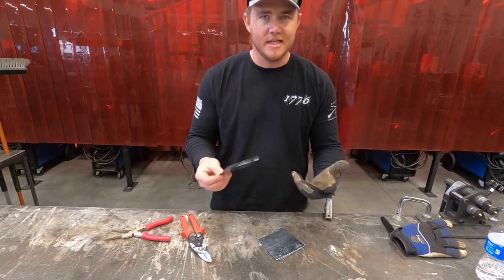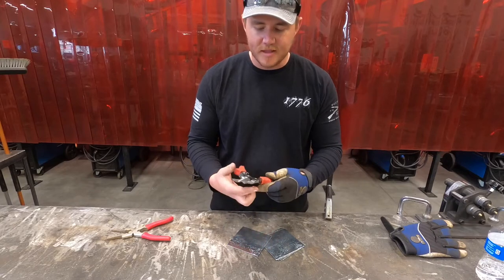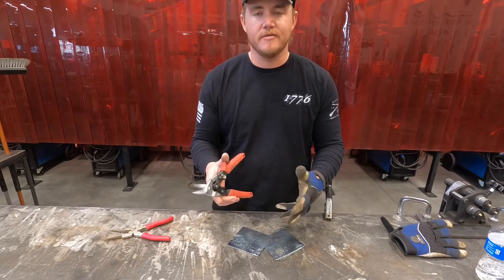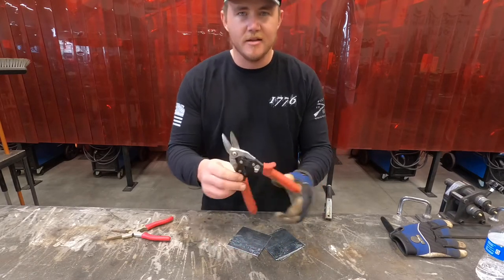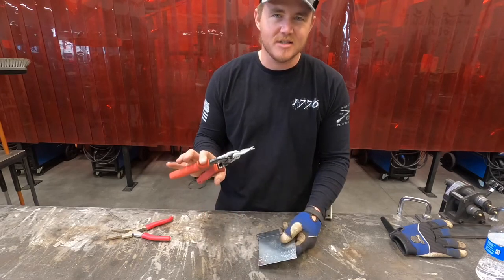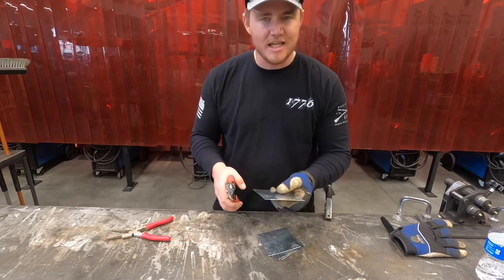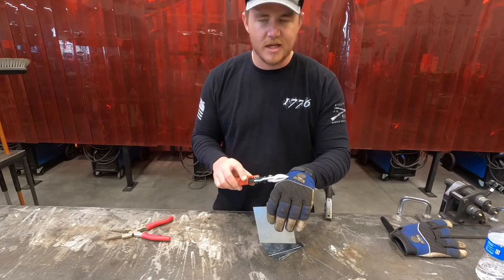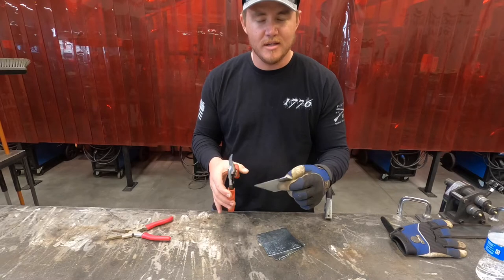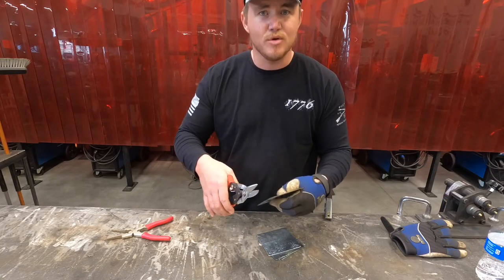Now that we've got our four-inch squares, the next step is to cut them into circles using aviation snips or tin snips. The ones we have are left-cutting — they cut left or straight. If you try to cut to the right, it's really difficult and your cut won't be clean. You can tell they're left-cutting by the 'L' on them — like scissors on steroids. This is 22 or 26 gauge sheet metal. The easiest way is to keep your sheet metal moving; I've got a glove on the hand holding the metal since it's really thin and sharp.